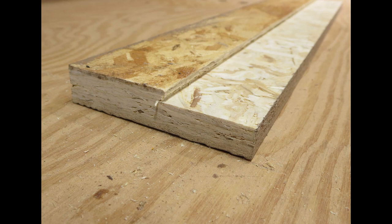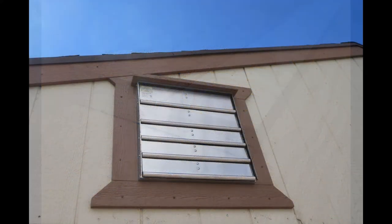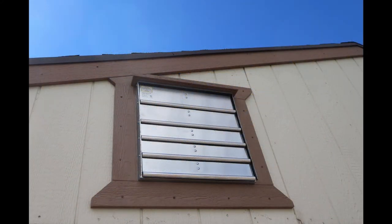To finish up on the outside, I was going to add trim all around the louvers. To do that I had to cut a rabbet to fit over the flange. Here's what it looks like from the outside with the trim installed — note the top cap. I painted all the trim before putting it up and caulked all the seams with clear silicone.